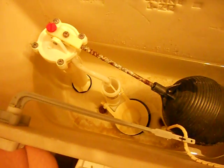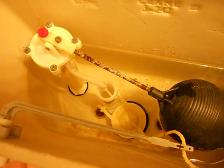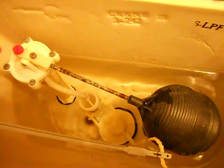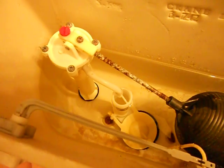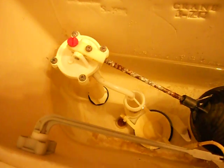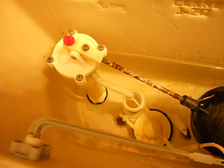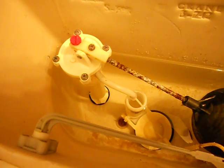If you're having problems with the toilet not filling up, or running even though it's already at the stopping point but still trying to fill up, then your fill valve has gone bad. And if you live in the Ozarks, you know about our hard water — that happens quite frequently, as the water deposits get stuck in there and these things just can't operate anymore. A common fill valve is going to cost you less than $10 at a local hardware store, and you can just follow the directions on the box.